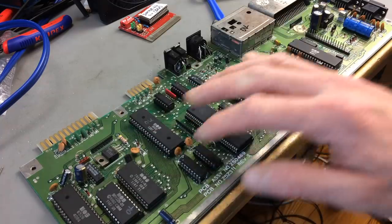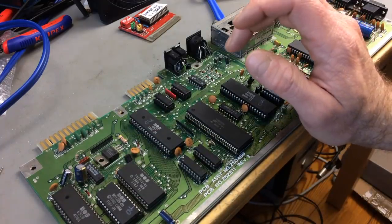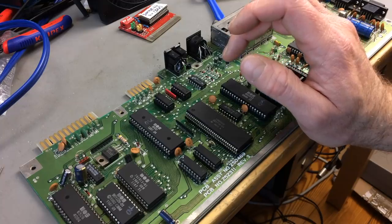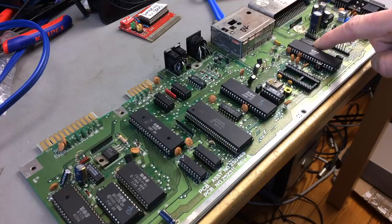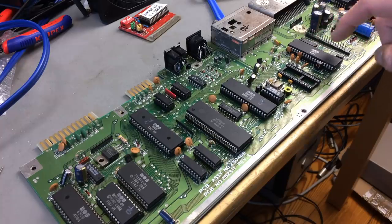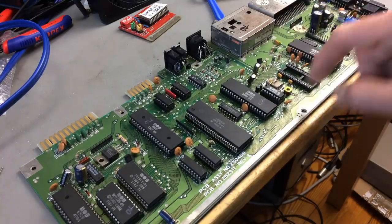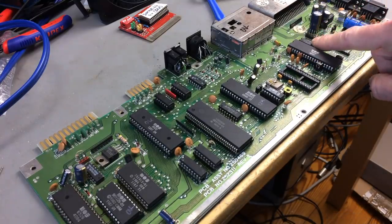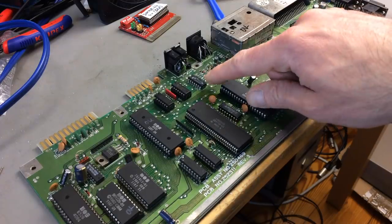Of course, there's a lot of small components that could be faulty. The ICs, I nearly replaced all of them. There's another 4066 here, but the levels on this were not present at all, because I think that's just for the keyboard input, as far as I can tell. So it only will have signals if you type on the keyboard, which is not connected in this case.